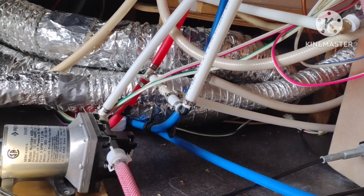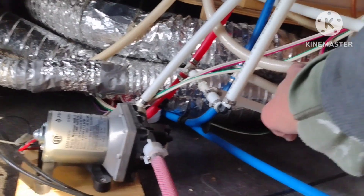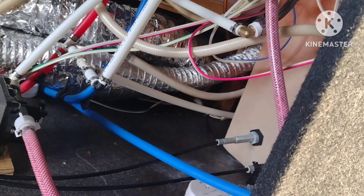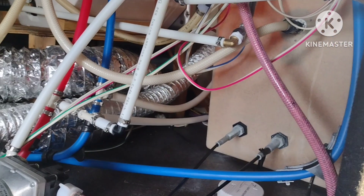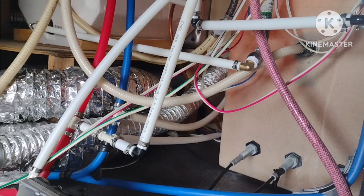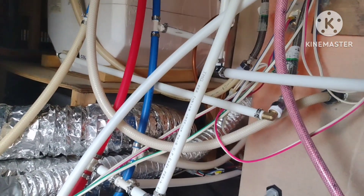I purchased some PEX hose, PEX clamps, and fittings, and anywhere they had braided hose connecting with a PEX fitting I started replacing it. I hadn't planned on cutting it all off — I was just repairing the leaks as they came. It started off with one leak, then I fixed that one, turned the water back on, and then another one was leaking somewhere else. That happened 12 times.